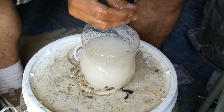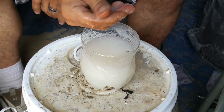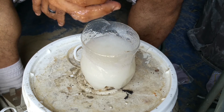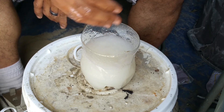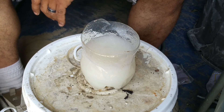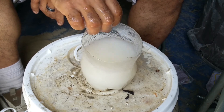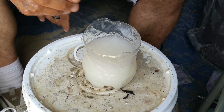But I think because it's so slimy, it doesn't allow the cement to bond — and that's exactly what happened when I made the air crete. It seemed like the cement particles just separated from the foam solution and condensed right down to the bottom. This didn't work at all. It gave the illusion of still being foam, but it didn't work well.